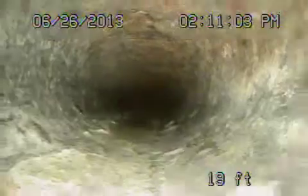We're going into cast iron pipe — this is underneath the house. Cast iron also looks like it's in pretty fair condition. Minor rust buildup on the inside of the line, but no root intrusion. All cast iron coming back, this is all in pretty fair condition. Still cast iron pipe with minor rust buildup. Overall in pretty fair shape.